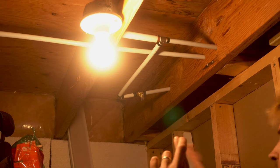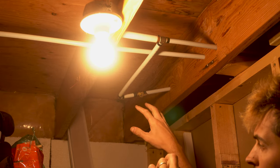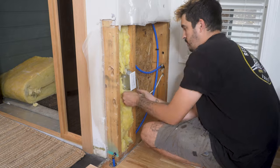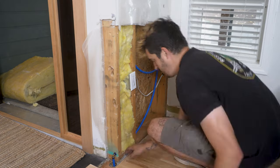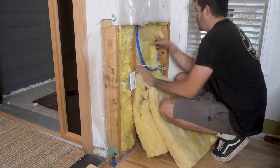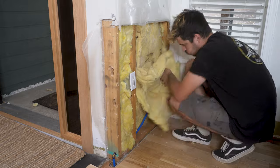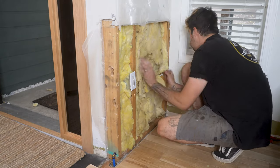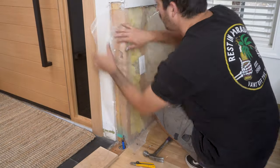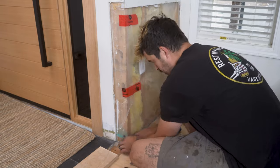Once I was satisfied with the plumbing, I then turned on the main water down below and listened for any leaks or screaming — and we didn't hear anything, which was good. I put the insulation back into place but peeled it in half so that the plumbing can sit in between it, so it can stay at room temperature and doesn't scratch or bind against the exterior of the house. I then put the moisture barrier back in its place, sealing up any cuts and splits that I may have made.